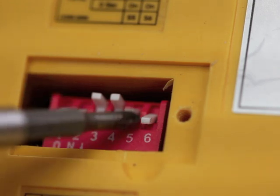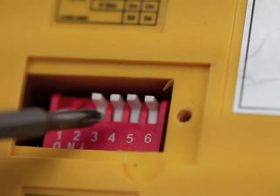Most woodworkers set both switch five and six off, allowing the dust collector to run for five seconds after all controlling tools are shut down. You can also choose 15 or 45 second run-on times, or immediate shutdown of the dust collector when all tools are switched off. I hope you found this product very useful. I'm Steve Maxwell, and thanks for watching. We'll see you next time.